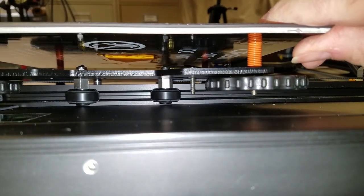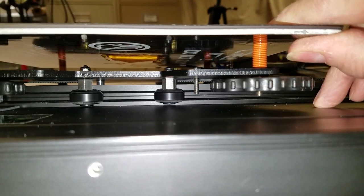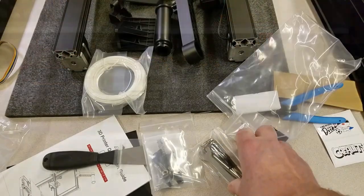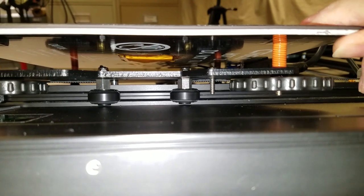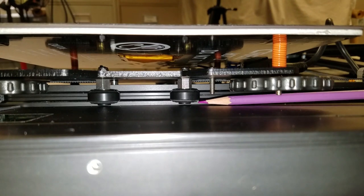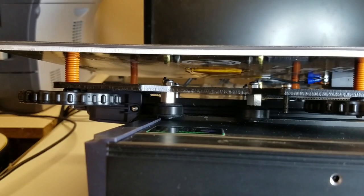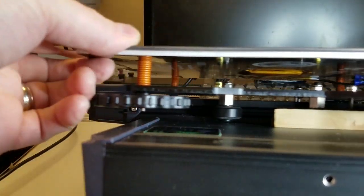From my previous work in the machine tool industry, and guidance from the internet, I know that the V-wheels used in these mid-market printers must be adjusted very precisely to avoid wear, flat spots, and slop. Luckily, Creality provides all the tools needed to do the work, just no guidance. I found the rollers were too tight and there was manufacturing swarf built up on them — Problem number two. I cleaned all four rollers using fine sandpaper glued to an angled wood block, and cleaned the V-rails of all debris. Finally, when everything was clean, I readjusted the two tensioning rollers using the eccentric nuts with the provided wrench. The rollers have to be just tight enough to slip slightly against the V-rail, but not so loose that there's slop. If they're too tight, the table will have flat spots and the rollers will wear out prematurely.